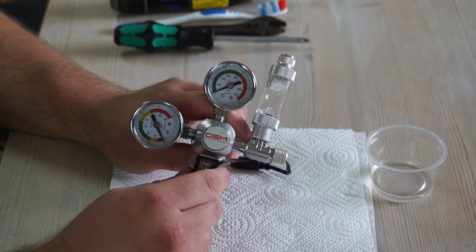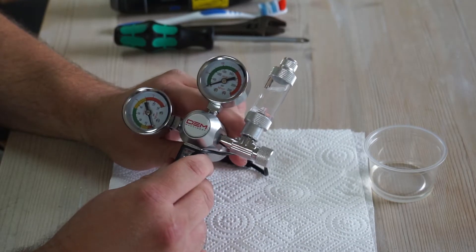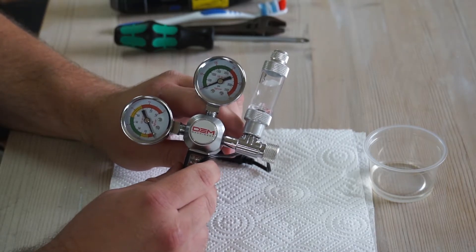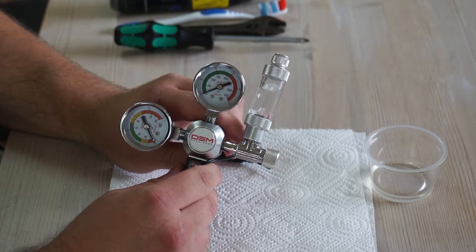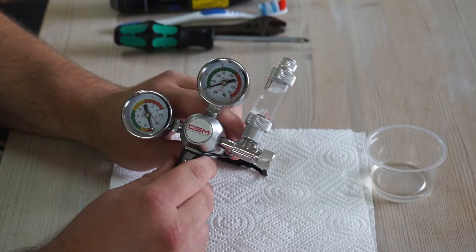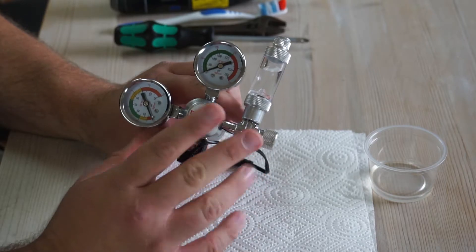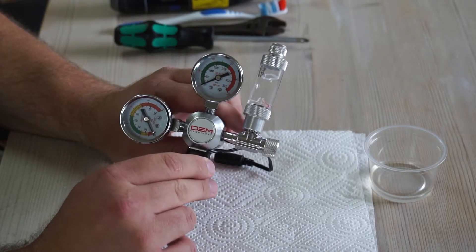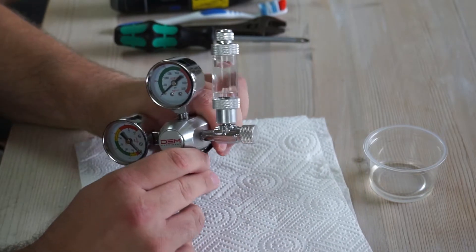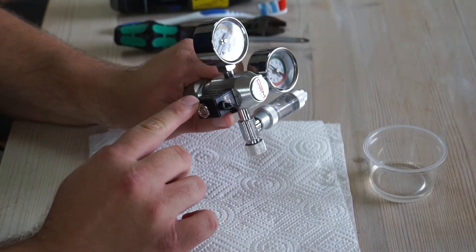That can actually be harmful to the fish — it can even kill them in excessive amounts. I was lucky as my tank is pretty stable with plenty of oxygenation, so no fish were harmed in my case. I'm not saying these are inherently bad regulators, but if you have one I would suggest you keep an eye out. In order to fix this, we want to get into that solenoid valve and clean it.